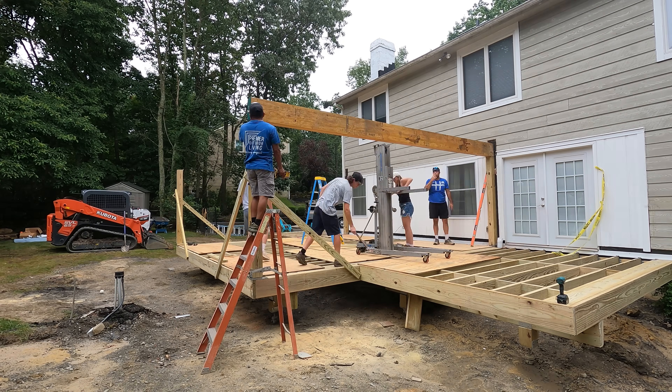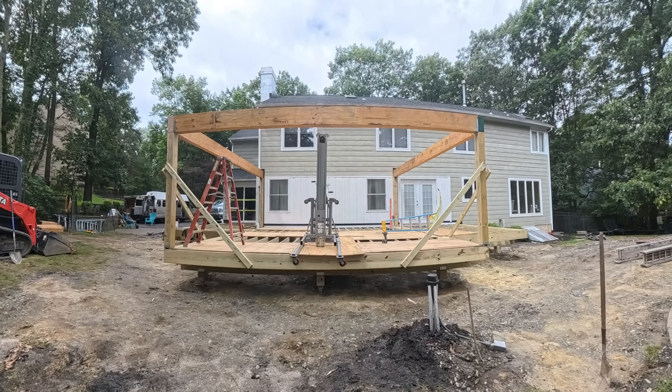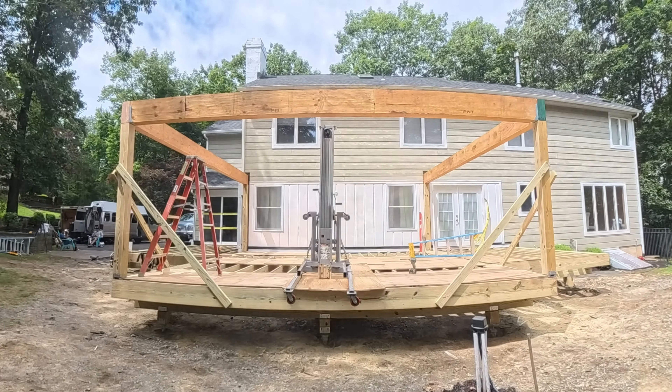On an A-frame roof like this, most of the load is going to be on those outer walls. So we're installing a 5.5 x 12 LVL for all three of our beams — two on both eaves and one across the gable side. Getting those installed, especially with larger beams, you're going to want to use a lift to make it easier to get them on top of the posts. Once the beam is on top of the posts, we connect it with a metal strap to ensure the connection is solid. Then we proceed to the next step — figuring out all of our numbers and the math behind rafter layout and roof construction. For this part, I'm going to bring in our trusted expert, Anthony Lombardo.